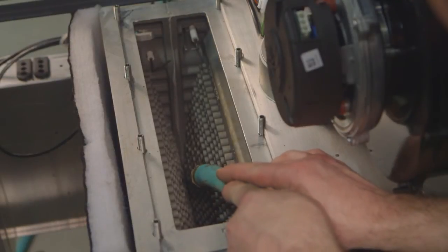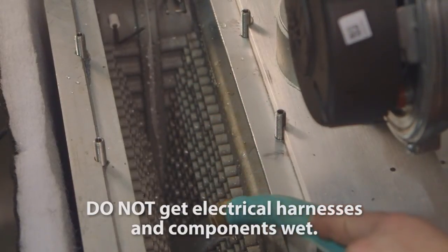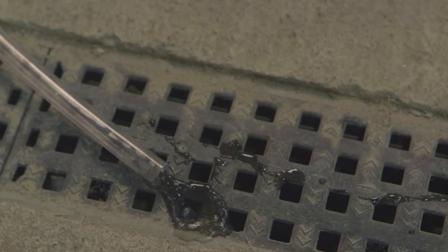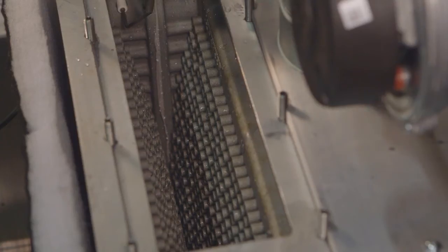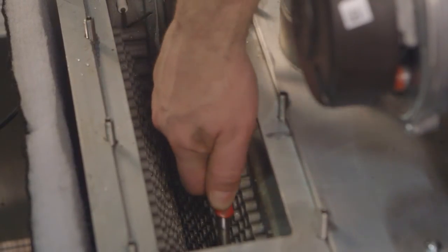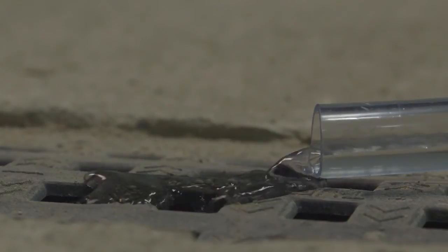After removing all of the burner modules, wash the combustion chamber underneath water. Do not get the electrical harnesses and components wet. This operation will help you determine if the condensate drain pipe is free of any obstructions — the water should drain freely from the condensate pipe as shown. Next, use compressed air to blow through the combustion chamber to remove any dirt that may clog the aluminum fins on the combustion chamber wall. Once completed, check the condensate drain line for obstructions and clean if needed.